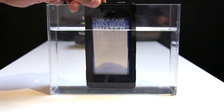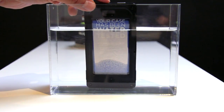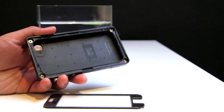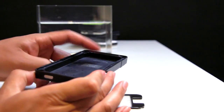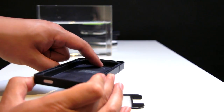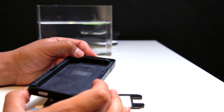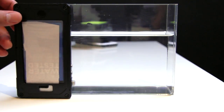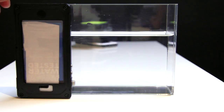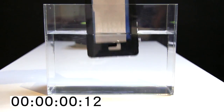So that's the bottom part of the case — the one with all the plugs and meshes. We're going to flip it around and try the top part of the case to see how quickly that part gets wet. One thing to mention is that the backside of the case actually isn't wet, so no water got in from the bottom. It looks like all the water seeped in from the top of the case, between the seal — this little raised edge — and the front panel. We've reinstalled a fresh piece of tissue and we're going to dip it in from the top side.